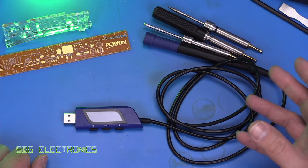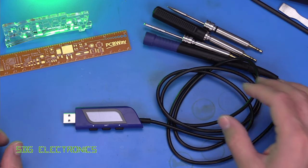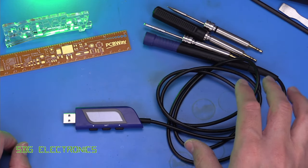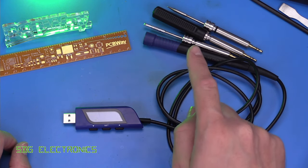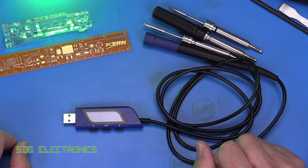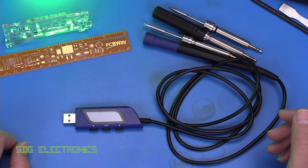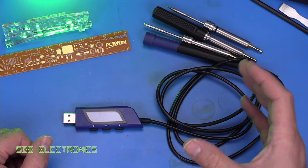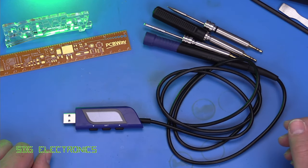So that's the ATEM GT2010 soldering iron. As a soldering iron it does work - you can do basic through-hole soldering and some surface mount work, and it's quite comfortable to use. But I don't really understand the market for such a low-power soldering iron. Once you've added one additional cartridge, which you'll almost certainly need since the pointy cartridge isn't great for soldering, you're spending at least £50, and probably £65 with the optional stand. Compared to other USB soldering irons we've looked at, those are significantly more fully featured, higher power, and not much more expensive.